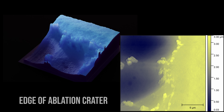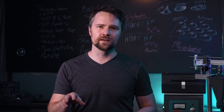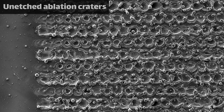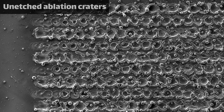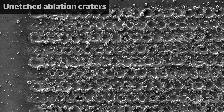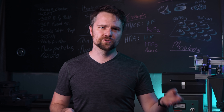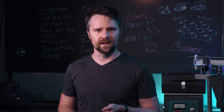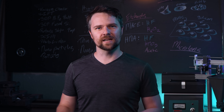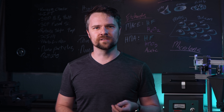All the silver region is essentially untouched, and not really porous or etched at all. From previous experiments using the laser on silicon, I know these impact craters are much more violent than this — there's lots of ejecta thrown around and usually a lip around the edge, a little melt puddle. So I was intrigued by this really smooth surface. It doesn't make any sense because the etchant shouldn't be touching the bare silicon there, but I thought it might be interesting to find out, and maybe we could leverage this spherical nature to make a microlens array.